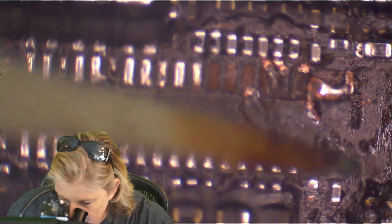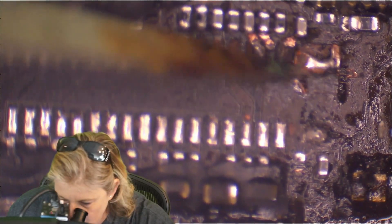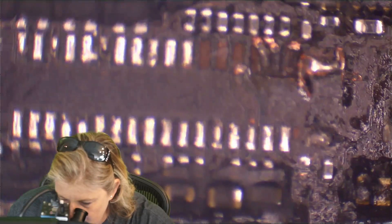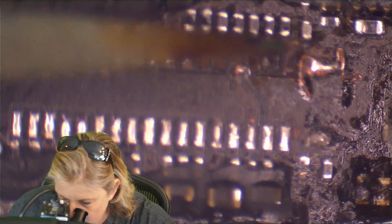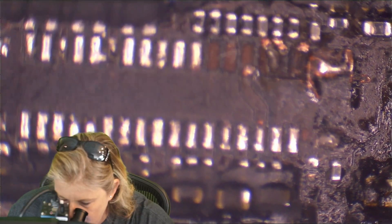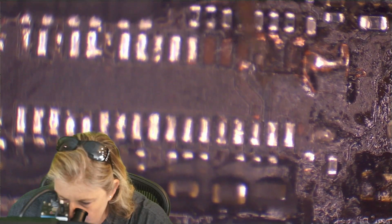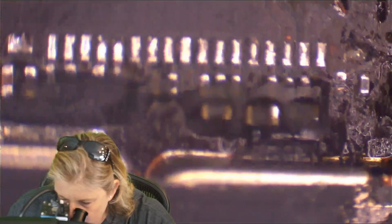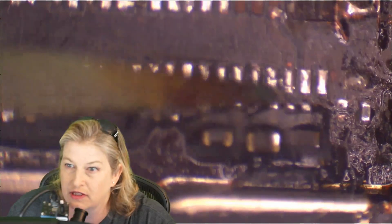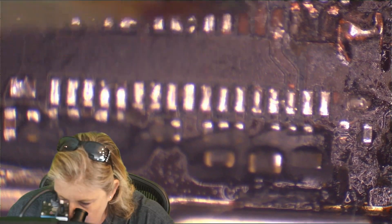It looks like this lifted one here was our VCC main trace that unusually goes here to the end of the connector. So we'll have to repair that, and then we're missing a pad that obviously goes here to this guy. The second one goes here to this guy. The third one we can move over — he's maybe okay. The fourth one is a connection; this one's going to be tough. It's just a connection over here to this other pad, so we'll have to fix that with a micro jumper and some UV glue.